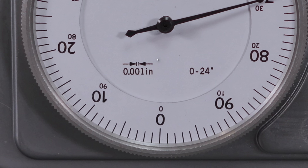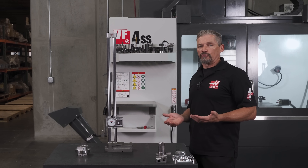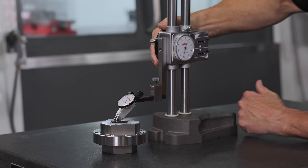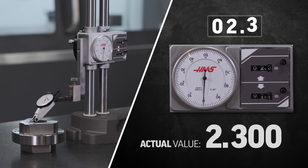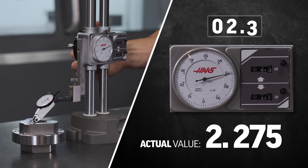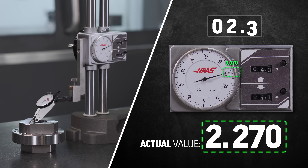Reading the dial is just like a big dial caliper — these are my one thousandth increments, or 0.001 inches. Moving to the counters, we have whole inches on the left and tenths of an inch on the right. So checking that same 2.270 dimension as we descend from above the part, we see two inches in the left column and 0.3 inches in the right column as we get close to the surface. I'll stop here with the needle on zero and the counter showing 2.3 inches — that means I'm at 2.3 inches off the table. Since we haven't touched the part yet I'll keep moving down.